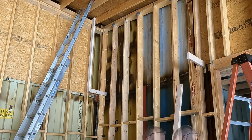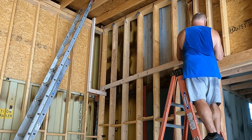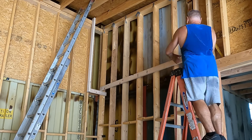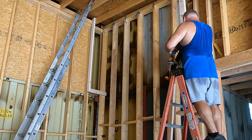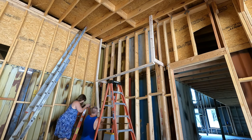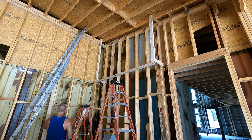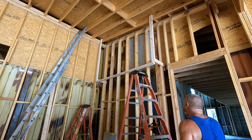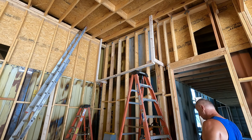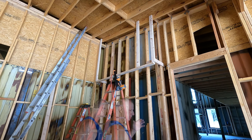It was quite warm — sweaty as I am at the very end. Being on an 8-foot ladder, I was on top measuring stuff out. I could have done some math to figure out the sizes of the 2x4s, but I just measured them while building the structure. The main hard part was getting the 2x4s started at the bottom of the dormer; the rest basically went from the framing out towards the dormer. Once everything was leveled out, I just measured the 2x4s coming down from the ceiling and snapped them in place. The hard part was getting the first one — a little bit of help from Angie there.